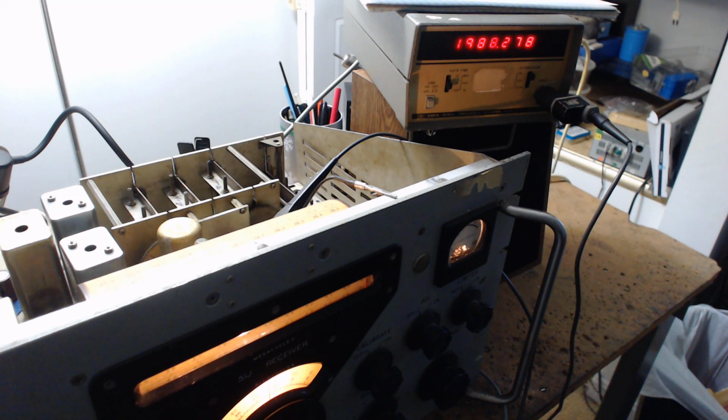And then I was working. If you saw my video on the PTO, I didn't have enough density of material that doesn't drift or doesn't change with temperature in order to tune that coil the way I wanted to. So I've gone back to the original design of making a Franklin oscillator do the bandwidth. I have to wind a new coil, and the problem is my knob's going to be backwards. It's going to be inverse.